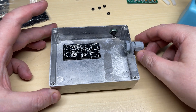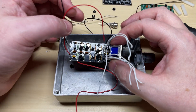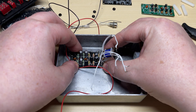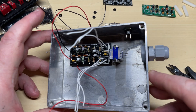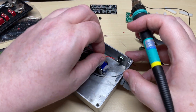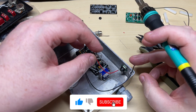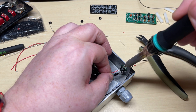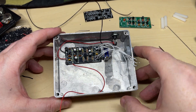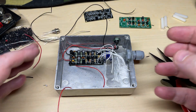With it being a metal box it's got a little bit of weight to it. There's the two-tone audio generator with the audio transformer already fitted. The board fits down nicely and those screws we've put in — we'll drop some plastic bolts on top to secure it into place. We connect up the power, which is just to power the two-tone board. I've also connected a couple of extra negatives which we will need, and I put a little bit of double-sided tape on the transformer just to hold it into place.